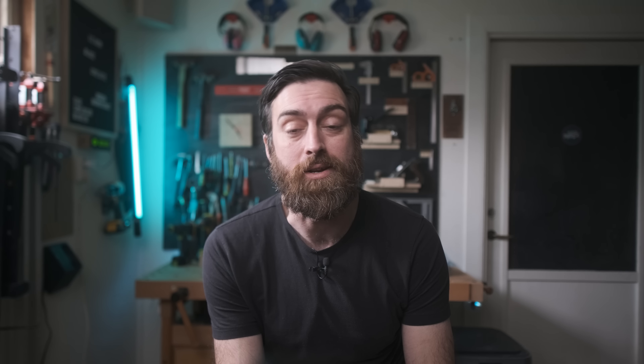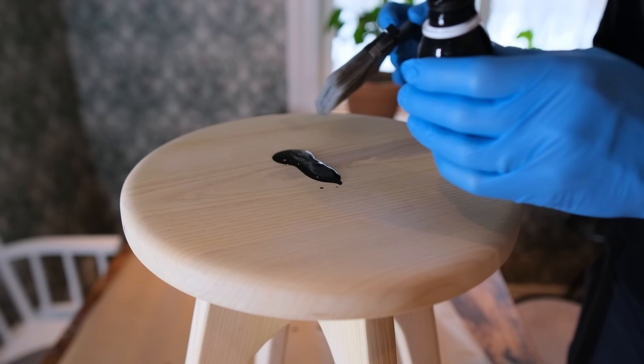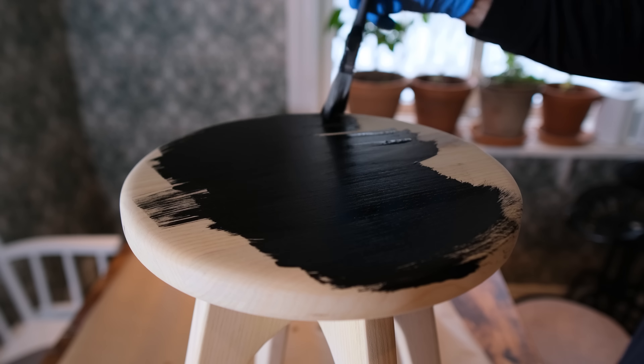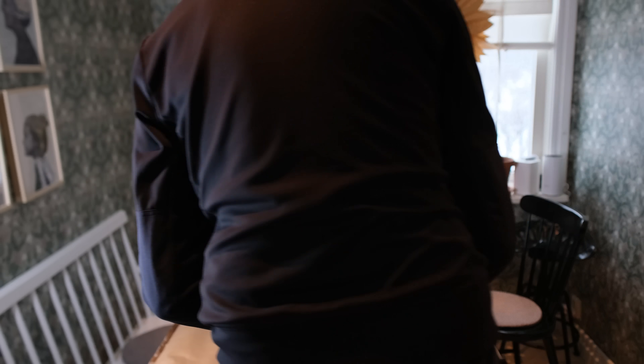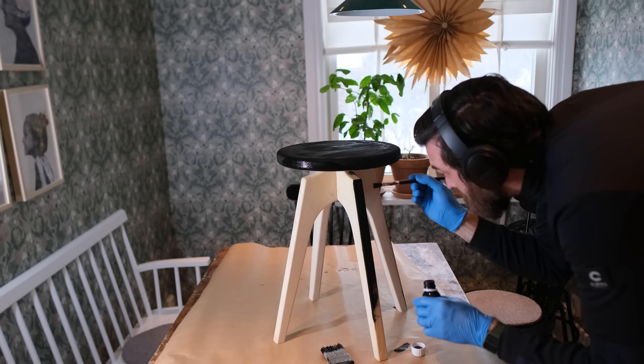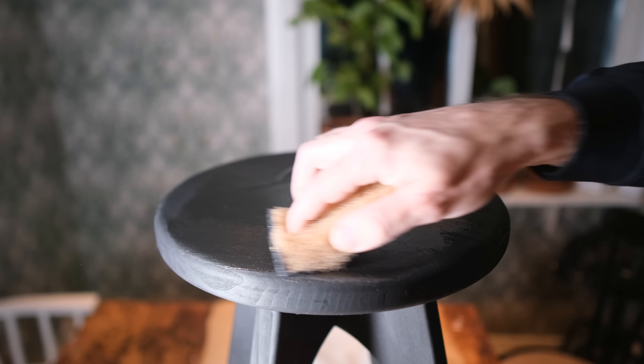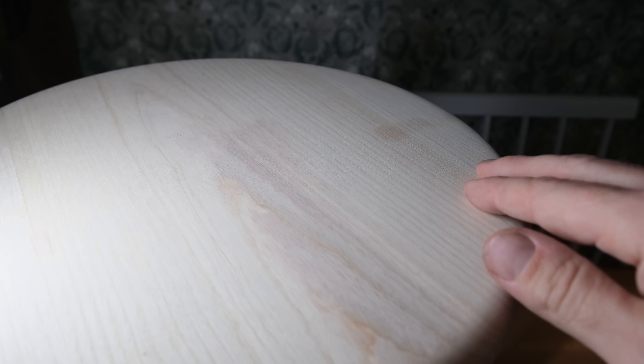I lost patience clamping and broke the rules by using some bigger clamps — sorry. Since I was already out of budget, I gave it a coat of Rubio Monocoat Intense Black and charcoal hard wax oil mixed with gold powder. It gives a subtle glimmer to the finished piece and I love how it looks. The ash also had some water stains I wasn't able to sand off, and staining was a lot easier while giving a look I really liked.